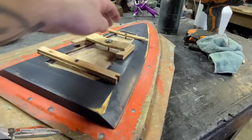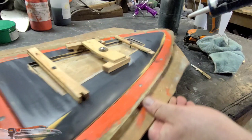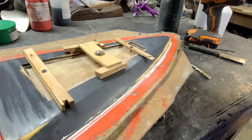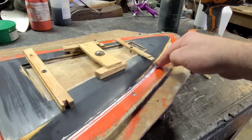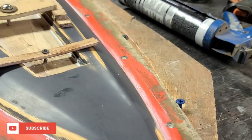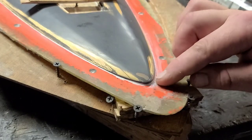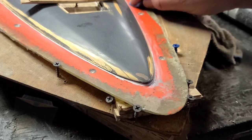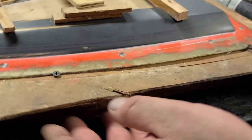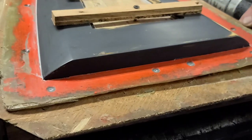Now the boat's glued into the mold with a couple extra supports for a nice tight fit. I'm taking caulk and going around the edge — you don't need a whole lot. Then we'll clean up the excess. One tip: do your final waxing after you put your caulk down, because the caulk won't dry if it's waxed beforehand. I found that out the hard way — it took five days to dry instead of 15 minutes. Clay would be better, but that's what I've got.